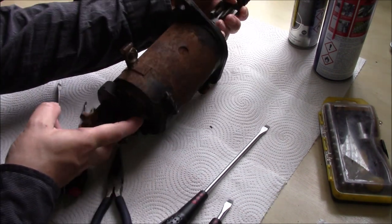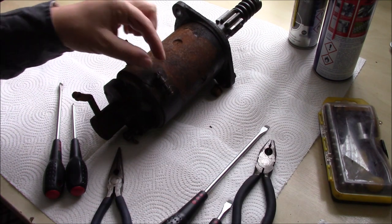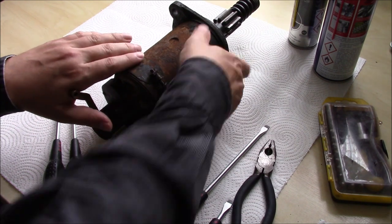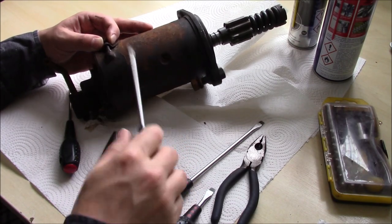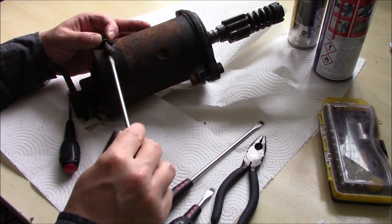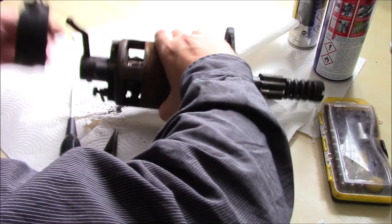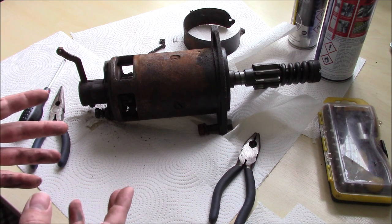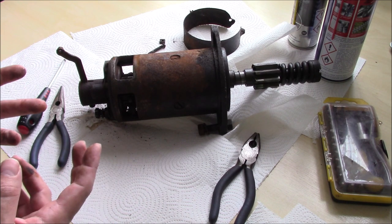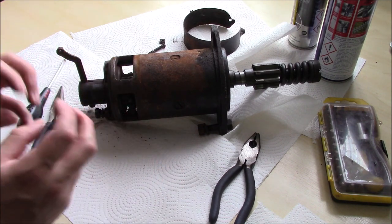First thing we want to do is undo this bolt here, and there is a square nut on the end. With it being a square nut, it holds it in place as you unscrew it. This piece allows you to get access to the commutator and the brushes so you can see what sort of condition they're in. I'm going to take this band all the way off because I want to clean it and give it a bit of fresh paint. But normally you just loosen this and then you can slide it out of the way. I wish I could describe the smell that comes out of this to you. It's a bit like Hornby Triang and Bakelite sort of jumbled together and like ozone over the top. It's a really distinctive smell.